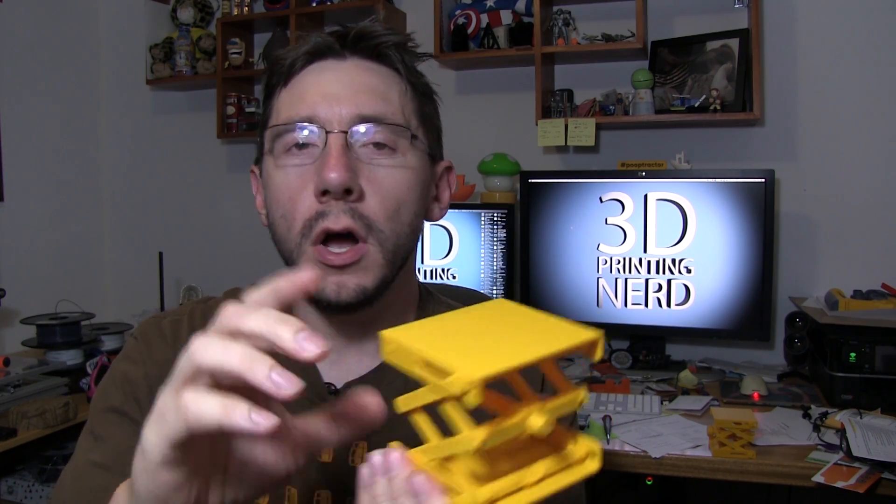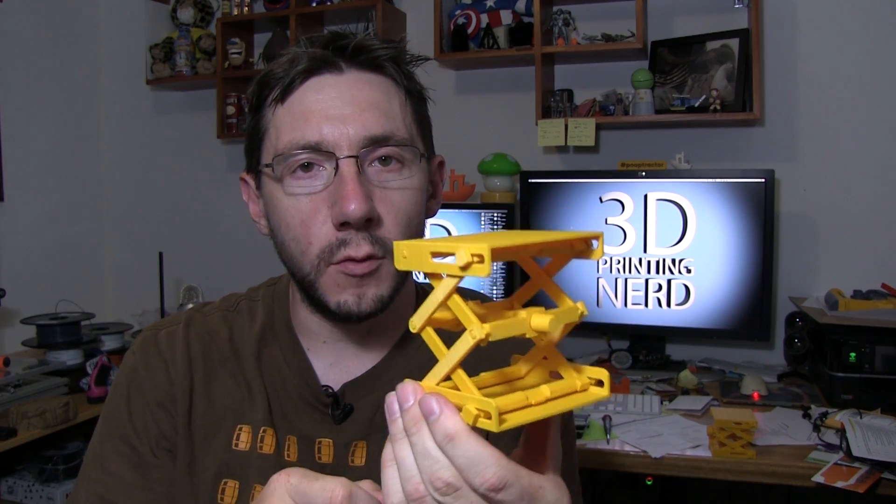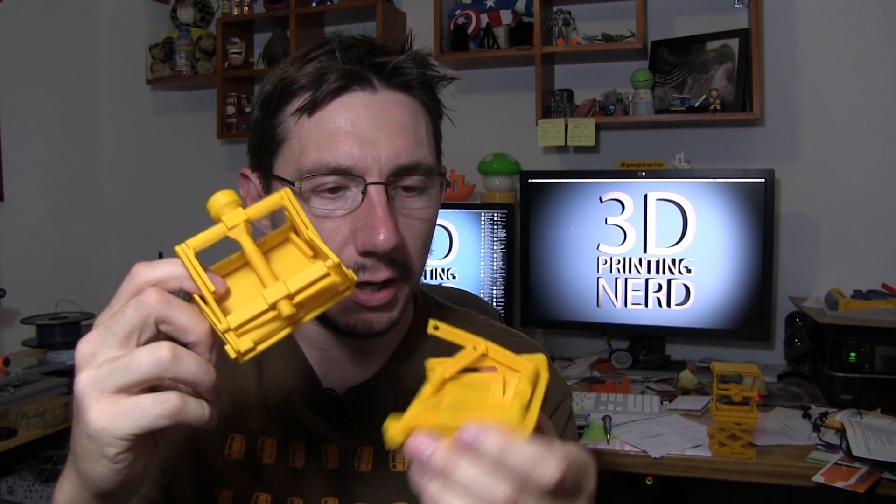As you can tell, it prints all as one piece. However, the tolerances are really close. They've updated the file on Thingiverse and I'll put a link below — it should print a lot better for you. My first attempt didn't turn out so well, as you can see it's in a couple pieces. The problem is the tolerances were too tight and pieces stuck together that were not supposed to. I used a feature in Simplify3D called horizontal size adjustment that allowed me in the G-code to print things slightly smaller. I gave it a minus 0.07mm horizontal size adjustment, and that was enough to increase the gaps and give me the working version.